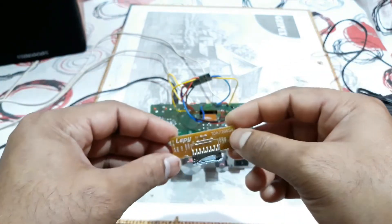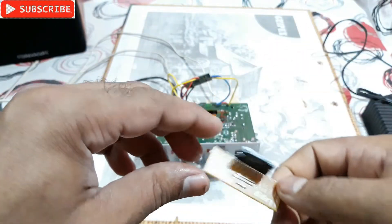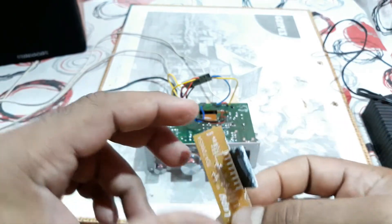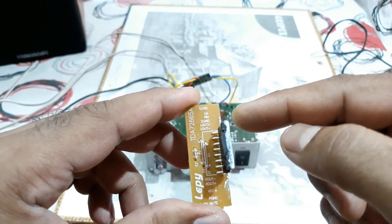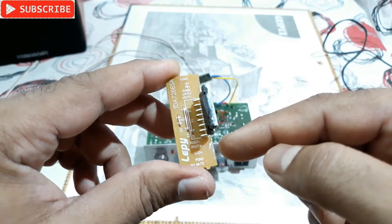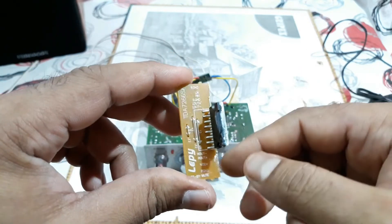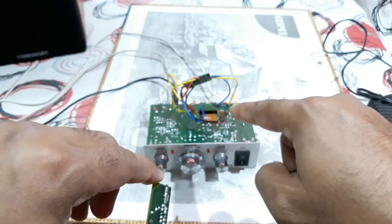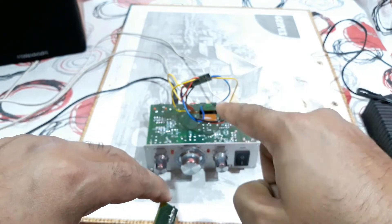This chip was mounted on a small PCB, which was mounted right there on the board. Since it's gone, I've removed it. You can see the connections are simple: L-in, R-in, sound ground, left channel output, VCC for power supply, power ground, and standby/mute. Very simple, and you can easily find these points on the main board to connect another amplifier chip.